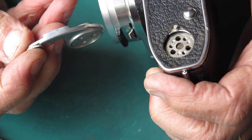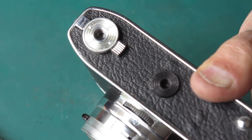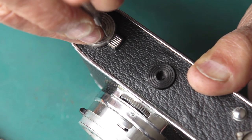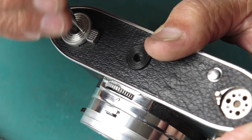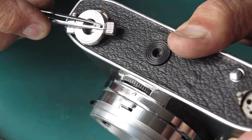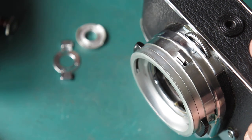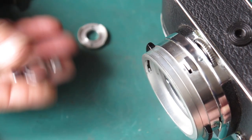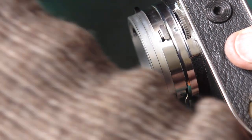Three screws here on the advance lever — no problem with that by the looks of it, should be good. This piece next is the cover for the back-catch release, and that does not want to move. Cover the screws and the spring — I'll put that to one side and keep all my springs together. These two pieces typically don't go through the cleaner; this piece in particular, you'd end up losing your black arrow if it went through the ultrasonic cleaner.